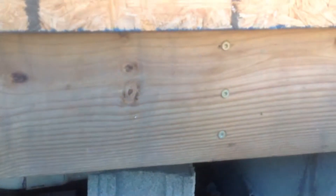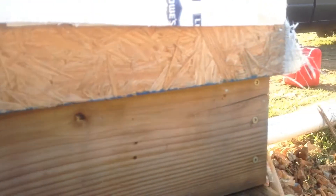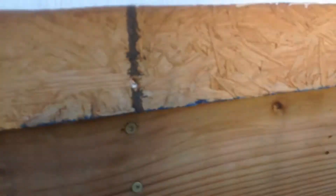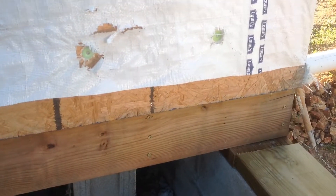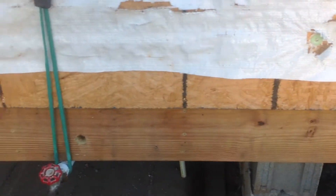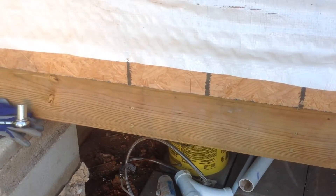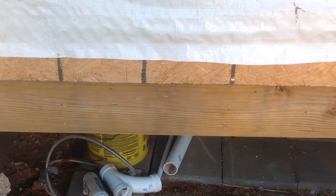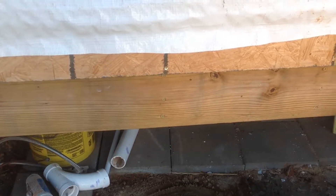What we may have trouble with here is our sheathing — we're probably going to have to cut it off. So I've got to take these screws out. I like using wood screws with sheathing and subfloor. I went ahead and cut the old wrap, which is kind of brittle and nasty and no good anyway. I cut it off up above so we can get the circular saw in there to cut that sheathing off and get our joists in.